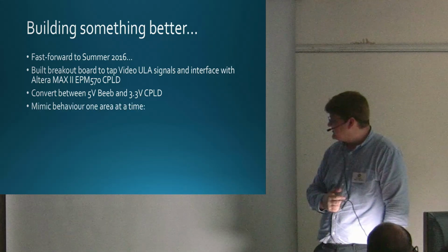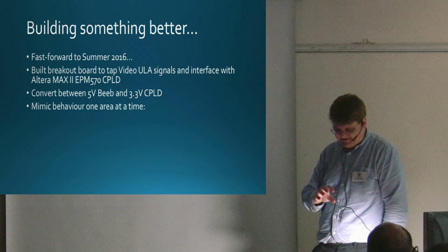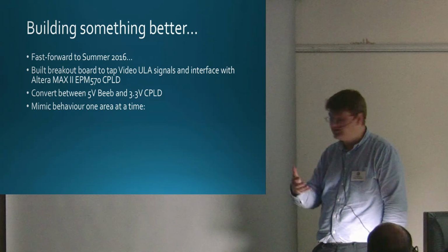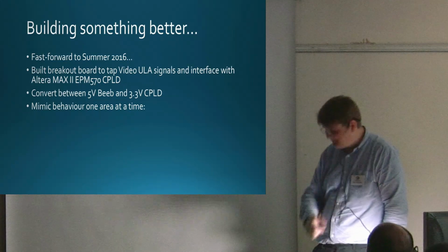And basically what I decided to do was just mimic the behaviour of the video ULA one error at a time. So I wasn't trying to do anything to enhance it at this point, I was just trying to see if I could replicate the behaviour of the ULA.